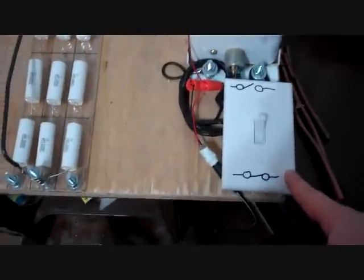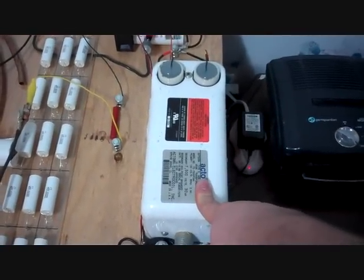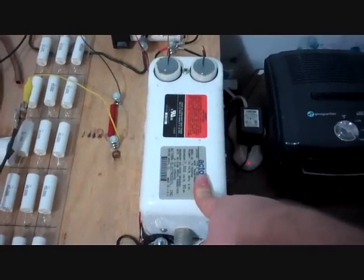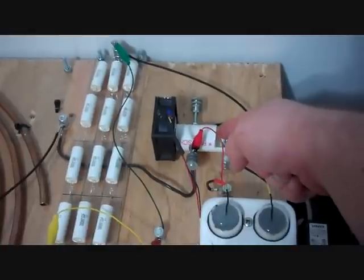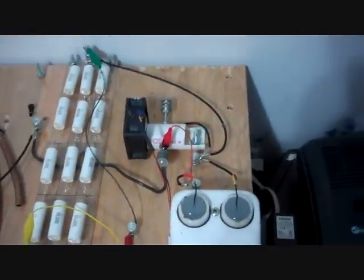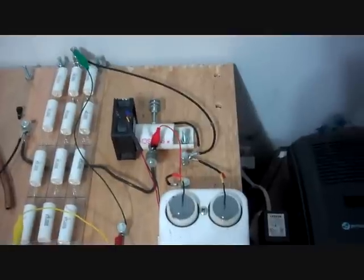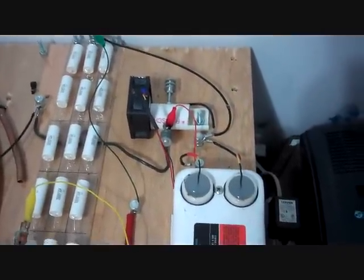Light switch — on/off switch. DC power to the quenching fan. 7500 volt neon sign transformer, 30mA, current regulated. 1.25 inch electrode spark gap set at 0.1748 inches gap, which is roughly 10,603 volts — that essentially allows the capacitor to charge up to full.